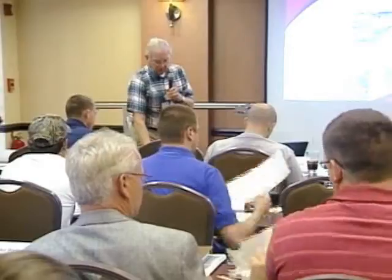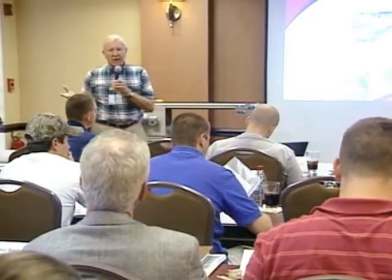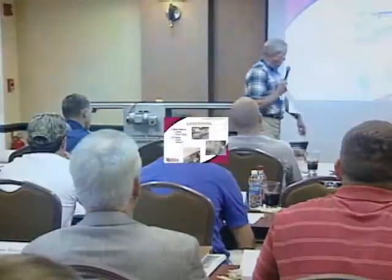Again, notice that these are fairly rigid type products. You have very generous pulley diameters, and you want to maintain those large pulley diameters so that you get good characteristics for total life. It's a very common product, very widely used. Everything from many different kinds of food to printing to anything that needs some temperature, but oftentimes it doesn't have much physical mechanical support. So these are fairly loosely woven products, and so you'll use drives and support mechanisms such as the grommets.